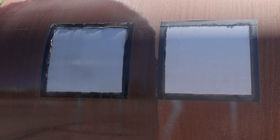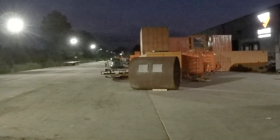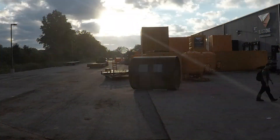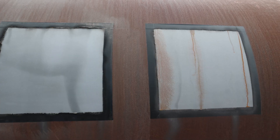We'll leave it overnight and see what happens. As you can see, the dry blasted square on the right flash rusted overnight. The square on the left that was mist blasted with Hold Blast is still white metal with little to no flash rust.